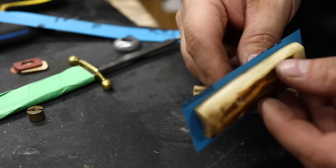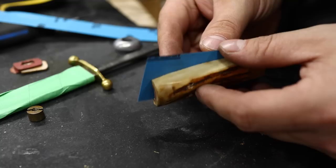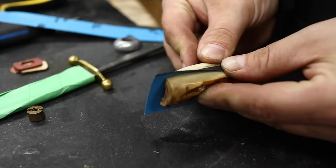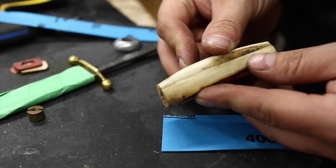We'll add a piece of sandpaper over one piece, then work the other piece against it with small movements so you don't start taking away the shape. These will start to lap together. You don't want to move them a lot - we don't need to remove a lot of material. The few high spots get worked down, and you can keep test fitting. See - already we're starting to nicely come together and ease together.